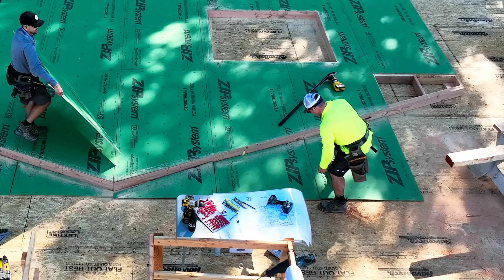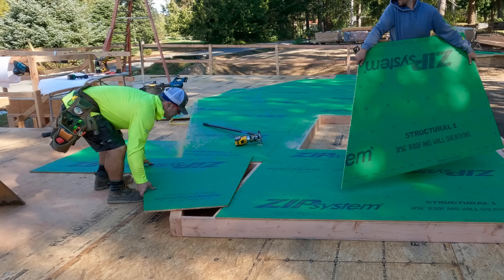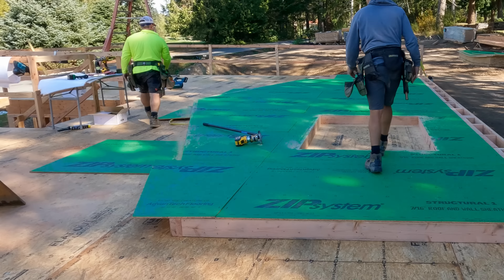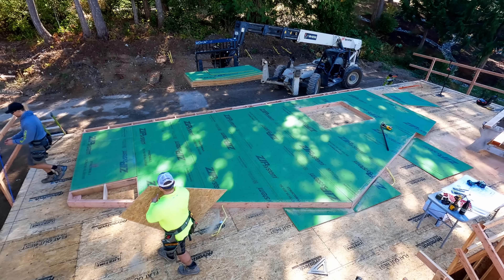Coming up the rake wall, I can just follow the plates. Here's the rule of thumb: you always want what you're cutting against or routing against to be on your left. For windows, it's clockwise. In this case, if my framing is on the left, then that bit's going to pull itself through and stay nice and flush. Ask me how many times I've done it backwards — the bit just goes right off to the side. We've got quite a few more rake walls to build, so we're going to use up all that scrap.